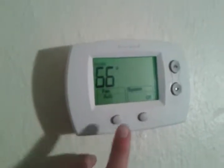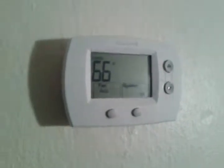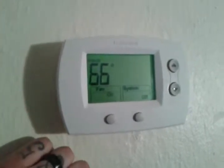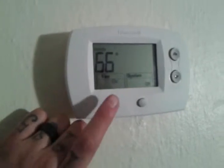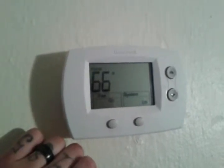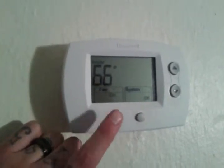On the other side we have the fan. The fan is set to auto, meaning only a call for heat will control the fan. But I can actually just turn the fan on by itself — there, it's set to on. It's turned off down at the breaker right now, but if it were flipped on, the fan itself would turn on and just blow straight room temperature air through the ducting system, which we'll see from underneath in a little while.